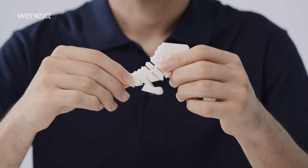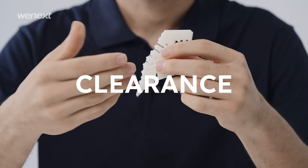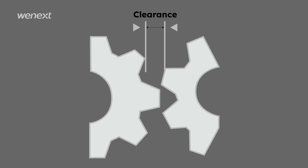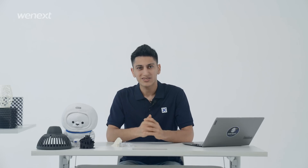One of the magic features of 3D printing is that it can even print mobile parts, like this one. There is one major rule that should be followed when you print mobile parts, and it's called clearance. Clearance refers to the distance needed between two connecting or mobile parts of a model. Support might not be removed if clearance is less than the required distance.